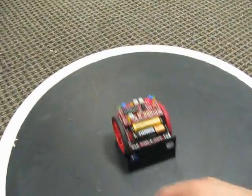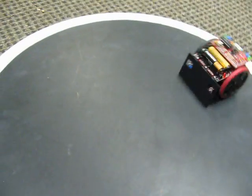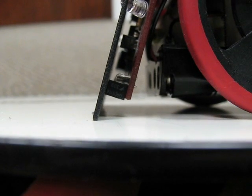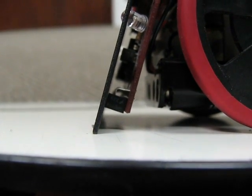It should follow my hand, kind of like an opponent being in the ring with it. You want your edge sensors to sit about three millimeters to half a centimeter off the board, or else you might run into issues.